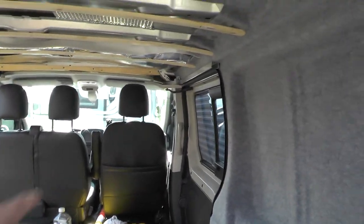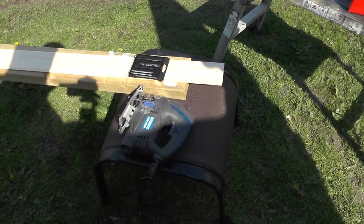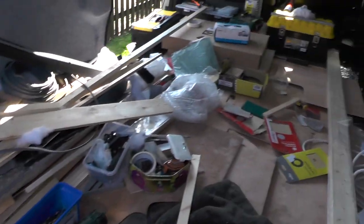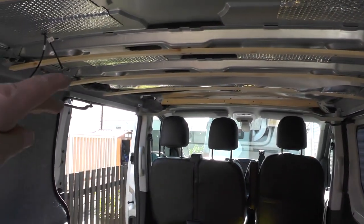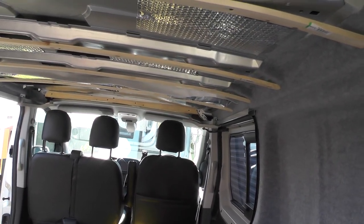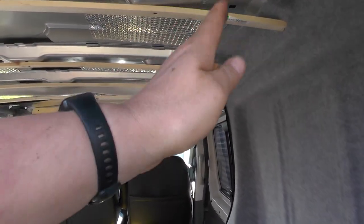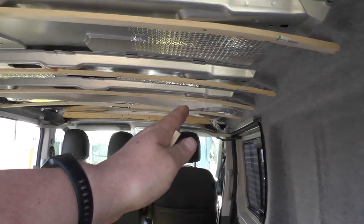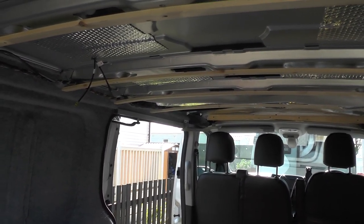I've put my wood all the way along now and I've marked up that piece — offered it up and just marked where I need to cut it away there. I'll cut that with a jigsaw, offer it up, and keep moving it until it's perfect. Then I'll lay it out, stain it, and fit the first piece. I was going to start in the middle and work my way along, but my logic is: if I get one piece in nice and straight, I'll just work my way all the way along until I get to that end and then cut and adjust accordingly.